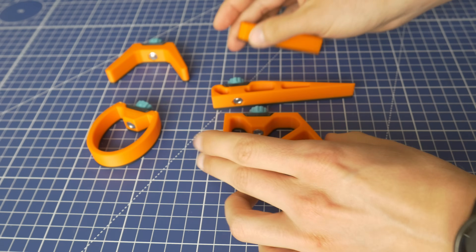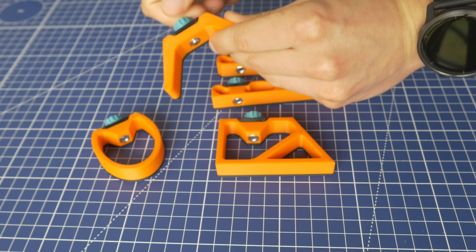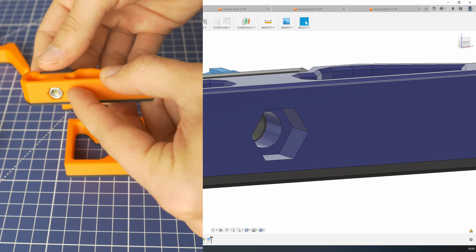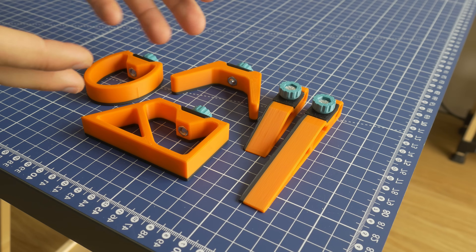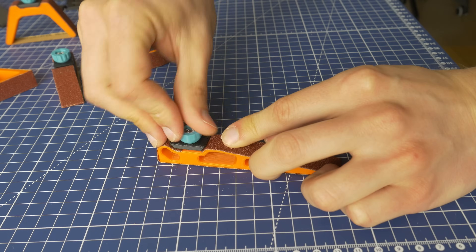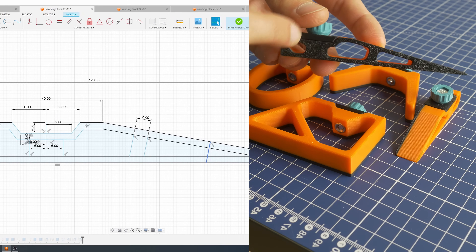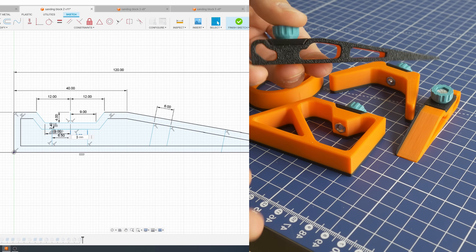Here is the very first 3D printed set of this element. I like it a lot — it looks very cool, but obviously there are things to fix in the first prototype. The screw does not fit inside the 3D printed nut very well; we need a tighter fit there. The nut does not fit very well inside the part, so when you are trying to tighten it, it might fall off. Other than that, I'm really happy with the shape of these elements. I think all of these will work very well for sanding very small objects for model making, 3D printed figures and stuff like this. This one does not stick to the bed of the 3D printer very well, so I will increase the contact area between this part and the bed — most likely just moving this line a bit and increasing the thickness, and that should solve the problem.